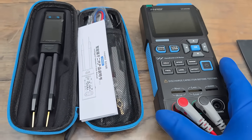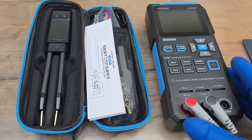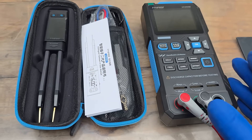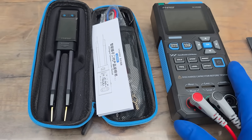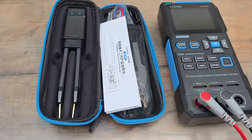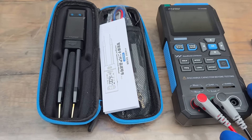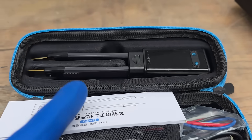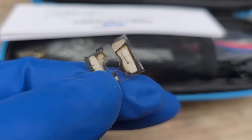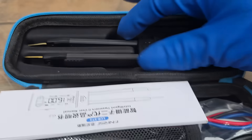These are basically LCR bridges, but they also tell you the ESR of the capacitor and you can select the voltage and frequency you want to test at. For bigger microfarad electrolytics, you want to use a lower frequency, and the smaller the value, the higher the frequency you want to use. The voltage is selectable too, which means you could use this to check for shorted semiconductors in circuit. Here's a silver mica wafer out of an IF transformer in a radio - we're going to set this up and measure that.